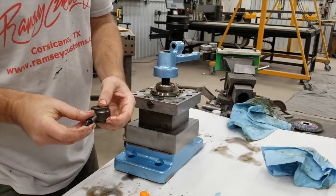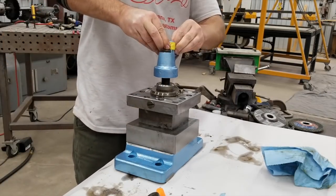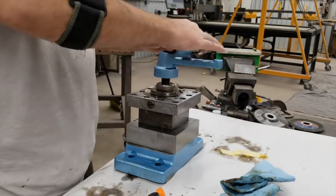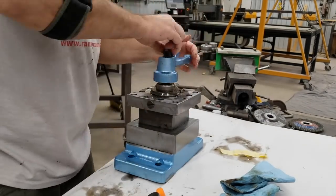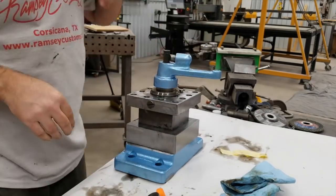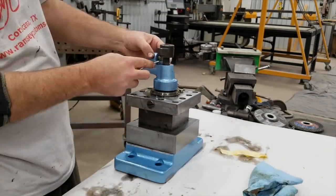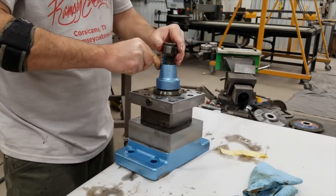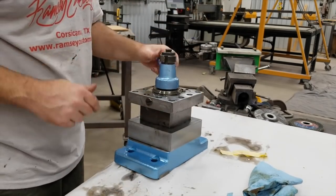I forgot the bearing there, so now we've got it going back. I tried some tape to hold that thing in and that didn't really work. So I just went slow with it and held it in with my finger to get it in. This is not a production job — we don't need to do 100 of them — so even though it didn't go that fast, it wasn't too bad in the grand scheme of things. Then the little boss — I don't know what you'd call it — that goes back on it fits on the splines as well, and that's what the actual ratcheting detent swivels around and locks into. That thing also had to be pushed all the way in while you got it started.